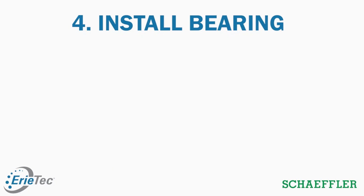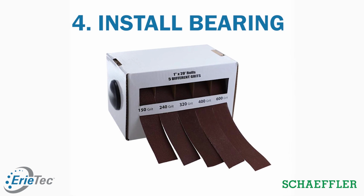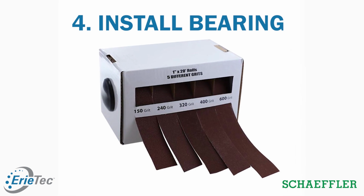So step 4 is installing the bearing. And actually, before you get to installing the bearing, you have to remove the old one. Sometimes when you do this, you can nick the shaft or cause a bump in the shaft. You need to take emery cloth and make sure those are all knocked down and make sure the shaft is in good condition under where your bearing is going to sit.